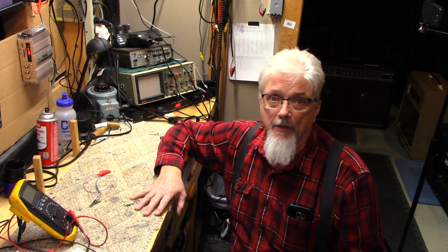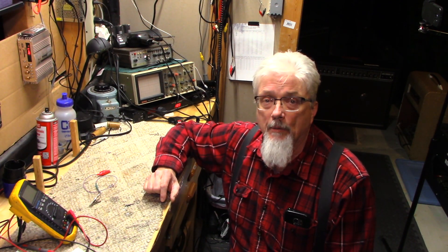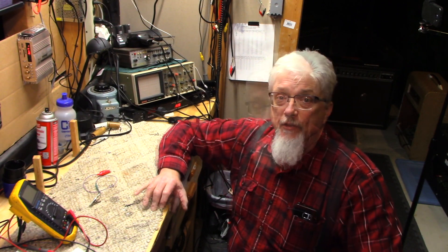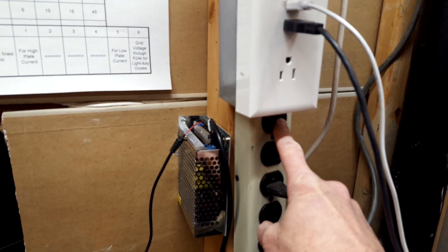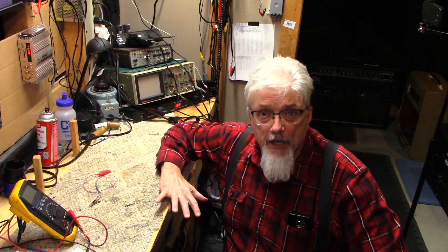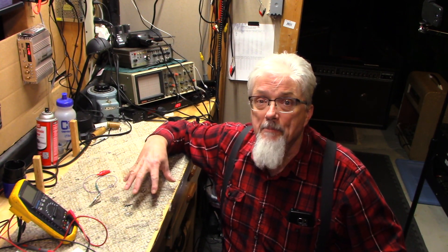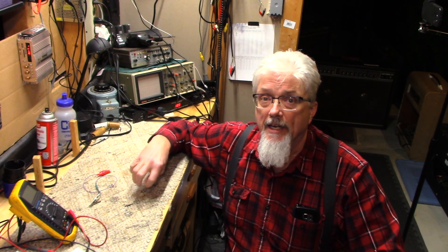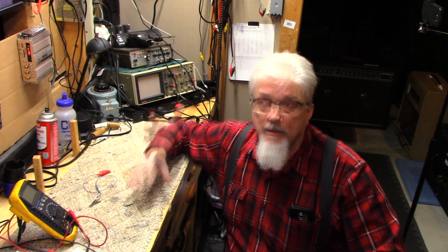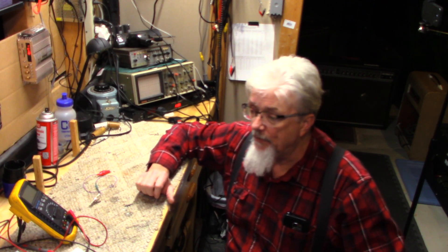The workbench certainly helps prevent that, since I'm not working around any metal. The second thing you can see is I'm working on rubber mats on the floor — a rubber mat keeps me from being grounded through the concrete floor down here in the basement. The outlets are all plugged into a GFCI breaker, because we're below grade — that's the code. If a GFCI senses an imbalance of current between the hot and the neutral, it will open, which helps prevent shocks from that perspective.